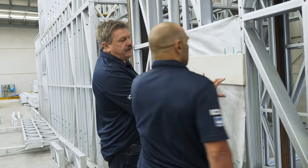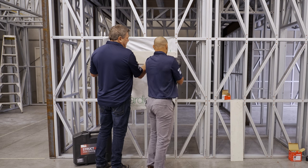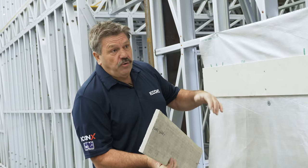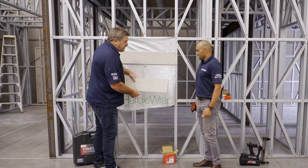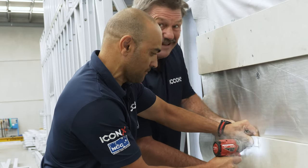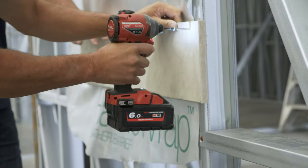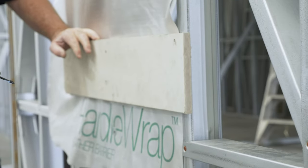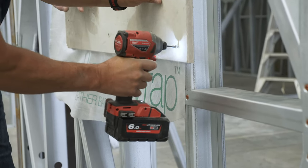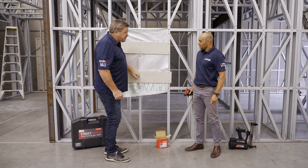Okay, let's get the board on. There it is, and we've got a 38mm in, and we're battery powered. Bang. Very nice. You get one in there for us in the middle. So the other conventional way of doing it is to put one of these screws in. Show us how that works in comparison to the strut nail system. Much slower. See, that's tough work — putting your body behind it, getting it in, individually loading each screw.